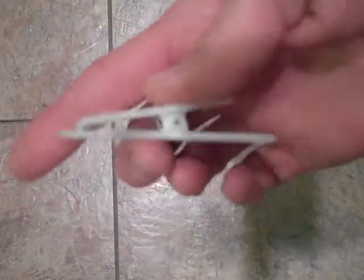If you use a screwdriver and try to remove this back plate and to separate the case from the radio, you're not only going to destroy this plastic here, you're also going to destroy the O-ring that surrounds this. Do not do that. For about $6–7 you can buy a tool that is made by Motorola. It's made for the express purpose of removing XTS radio cases.